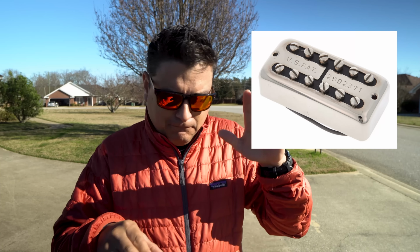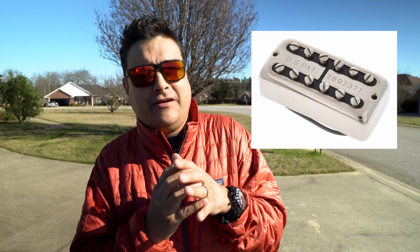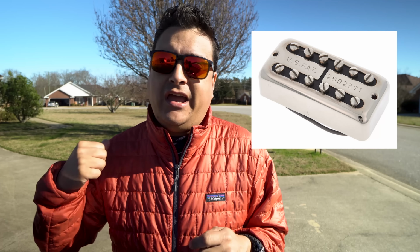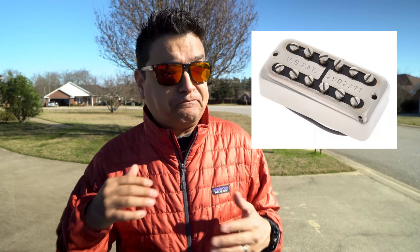Screws from the top hold it all together, tiny bobbins, big magnet, friction held together, usually not wax potted, kind of noisy, sort of microphonic. They can get unruly when you play them with a lot of gain, but it's still fun. The guitar player in my band actually plays one of these, a Gretsch hollow body, really loud, and it's really fun because he has to chase it. All right, so now let's talk about some more modern takes on that situation.